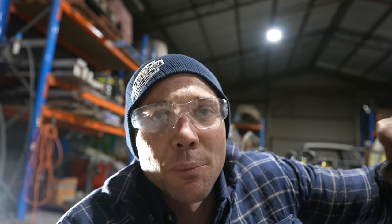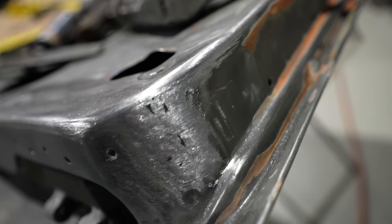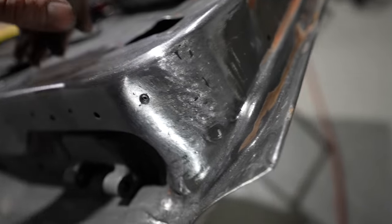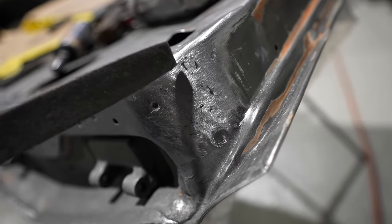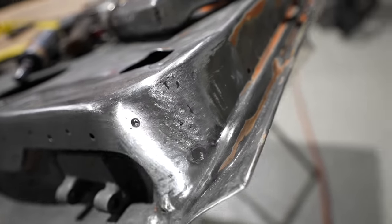Alrighty, that's my last file up, and that's the filing finished now. So I'll just prime over, build it up with epoxy primer, and I'll probably get away with two coats of epoxy primer. You can see with the file, it shows you little lows. There's a little low there, there and there, which is nothing. The primer will get that out.